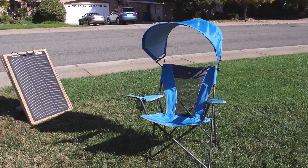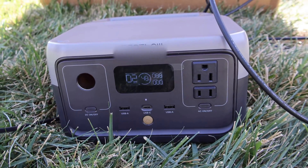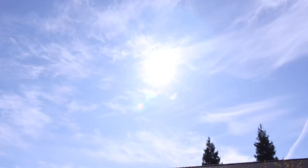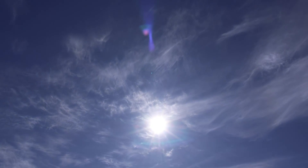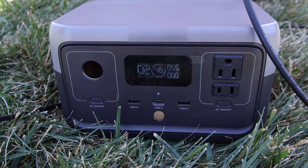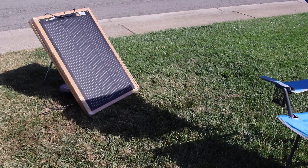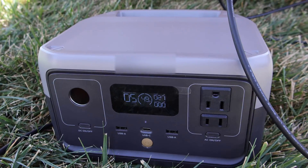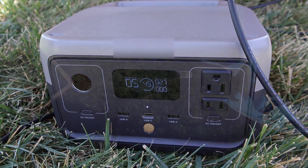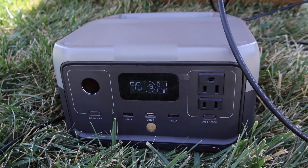Shade test time. Our shade will be enacted by that chair right there. Just to get some baseline numbers — we do have more high clouds. With just a little bit of shade, there's a good cut down on numbers: 55. Shading the bottom three cells, now we're at 27 — a big hit. And with about a quarter of the panel shaded, we're getting 11 watts.